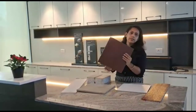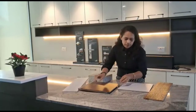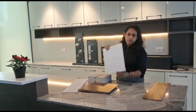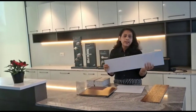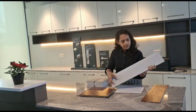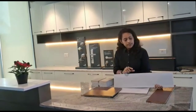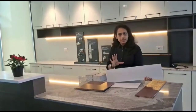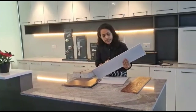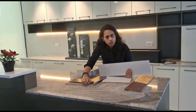And this is a pre-laminated board. Pre-laminated board comes in 9 colors, different kinds of wooden shades, and even white. And these are planks, which are mostly for exterior purpose. The basic material is the same: Bison Panel is made with 62% cement, 28% wood dust and 10% chemical and adhesive. Here this is an 8 mm plank. You get different thicknesses, starting from 6 mm to 40 mm.